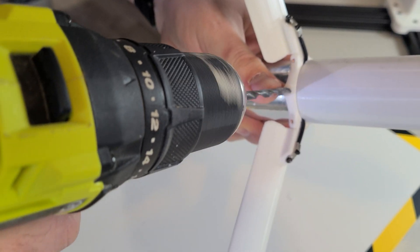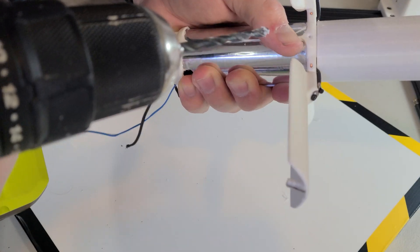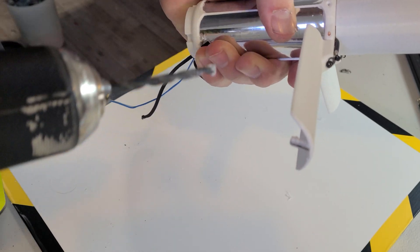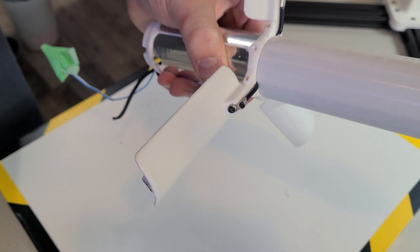You can see one of the little screw holes that's just used to connect the body sections. I used a 6mm drill bit to countersink the plastic so that the screws sit nice and flush with the body. And with that, she was done.